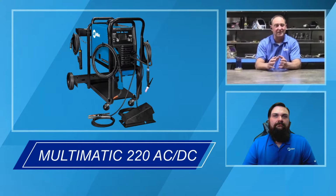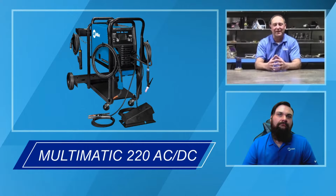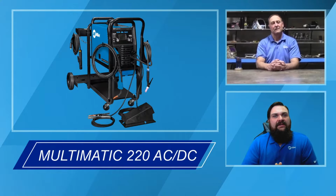The machine will automatically detect what voltage it is, and it's going to give you the desired output for the primary power that's coming in. And if it's 208 power coming in or 575, the machine does not get derated at all. So you get the same rated output on 208 as you get on 575. And that's going to be an advantage for a lot of people in their home garage as well. The 120/240 side of things more than anything, and that's something that we've got on a lot of these machines with the multi-voltage plug, in that whether you want to take it on the road, you want to hook it up to a generator, you want to take it in a race car trailer, something like that, where you don't necessarily have 240 capability, the machine still has a really nice low end, even on the 120 side of things.